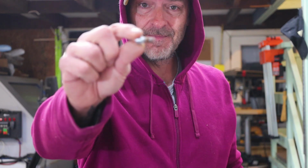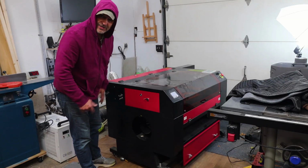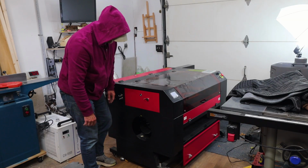So we all know with these machines, when they arrive to your house, the hose clamps aren't the best. So you need to get rid of those plastic little hose clamps and put proper clamps on it, because this bolt was right below those hose clamps and it's rusted out. So go through your machine, make sure you put the proper hose clamps on it. Let's see how heavy this thing really is without the stand.